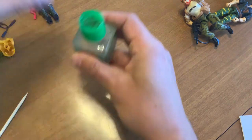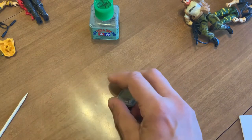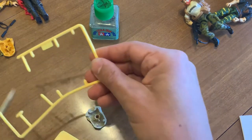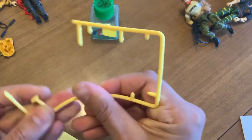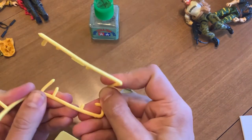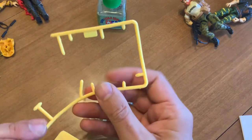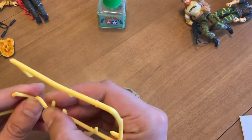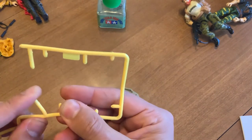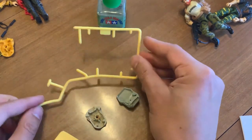Here's a test I recommend. First, identify the part — is it ABS, is it styrene, is it polypropylene? If it's really flexible it's unlikely to be acrylic. Some ABS can have a bit of give — Lego is a good example. In some Lego Technic gears the dark gray parts are a little soft because they add polycarbonate to the ABS. That's high-end stuff and more expensive.